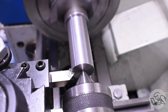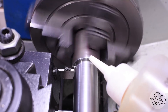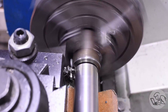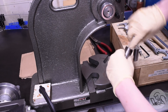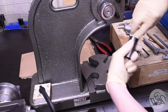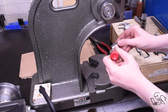I'm putting a generous chamfer on the end to assist with the press fit that is forthcoming, and now I can part off the other end. This is mild steel, but it seems to be good quality mild steel — it's parting pretty easily. There's half an inch of smooth bore outboard of the splines, so I'm cleaning and degreasing that area. I'm going to press the shaft into that area. It's tempting to try to engage with the splines themselves, but I don't know how much of that spline the motor shaft needs, so I don't want to use any of it up.